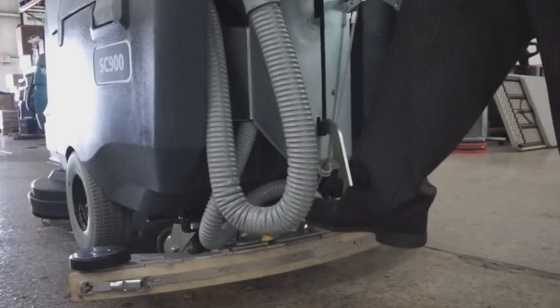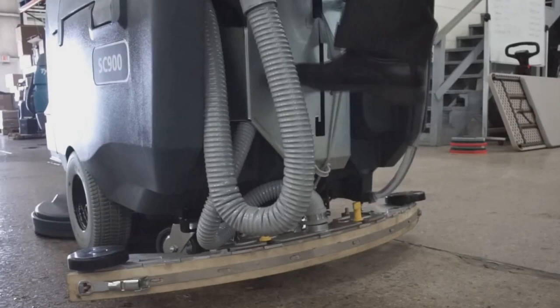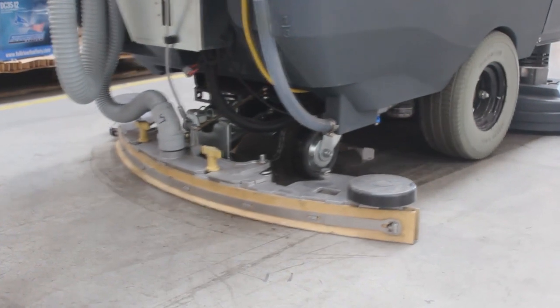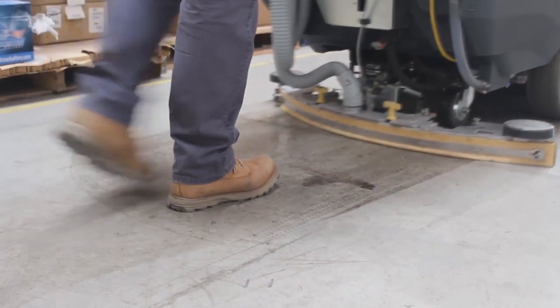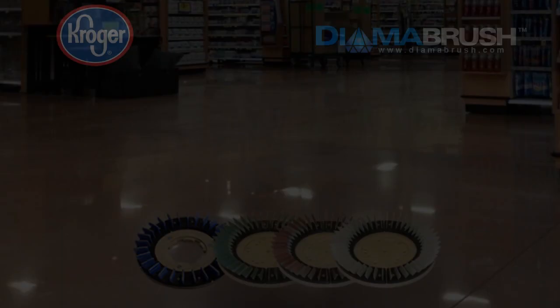Personnel should be operating the floor scrubber with the brush down pressure set at its maximum level. The water setting should be set at medium level. Keep the scrubber's vacuum running at all times to ensure that you are picking up the water left on the floor. Always follow the scrubber with the trail mop to avoid potential slip hazards.